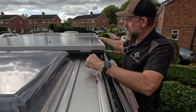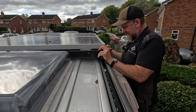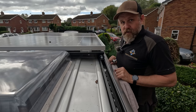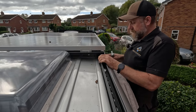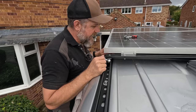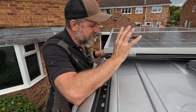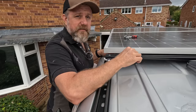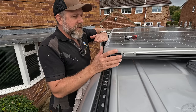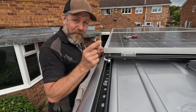I've loosened those bolts off and I feel a lot better about it now - it's not twisting the solar panel. We are game on, it's happening. I'm going to get the spacer plates in on all three first and then fix them down, then go to the other side. It's going smoothly, working as hoped. I'll get on the other side, get them done, and then we're going to measure and make sure there's plenty of room. If there is and the sky doesn't fall on us, I'm going to figure out how to lift the panel up enough to cut the hole, fit the fan, and put the panel back down - all today before it starts raining.